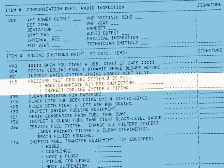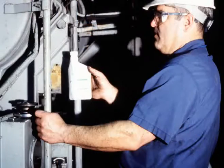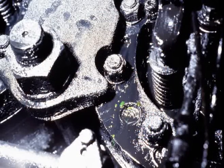At each periodic inspection, or if a lab code is reported, you are required to pressure test the cooling system. Prior to doing this test, it will be easier to find water leaks if a pint of fluorescent dye is added to the cooling system. Once the dye is in the system, you can use a black light to locate any water leaks — the leak will show up as a bright green spot against the dark background of oil.